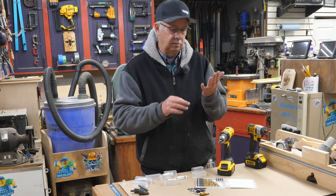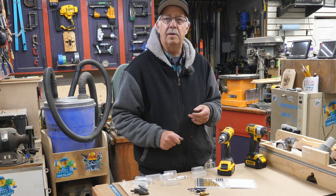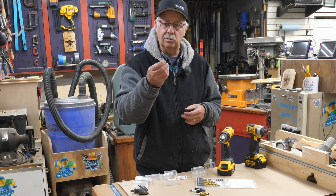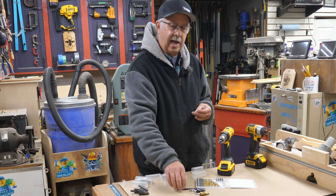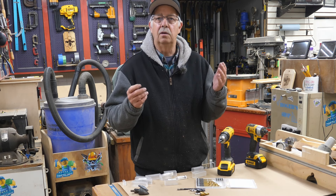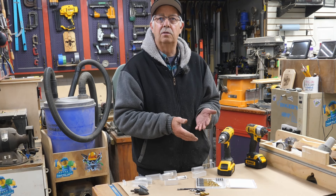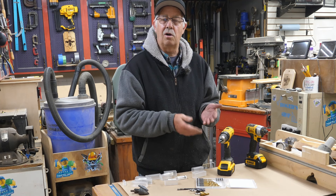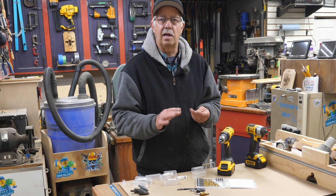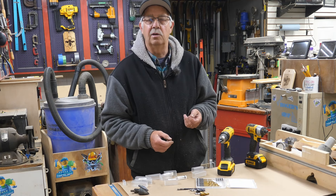What are these good for? Wood, obviously — though I'm not sure about using a step drill in wood. The hex drive bits work just fine in wood; maybe if you needed the longer one for some pocketed holes with a shoulder, that would work well. So: wood, fiberglass, plastic, aluminum, brass, copper, other soft metals, mild steel. These will not drill cobalt or hardened steel — for example, tool steel or tempered steel. That's not what it's for. Don't be trying to drill a hole in a spring with one of these; it's just going to dull.